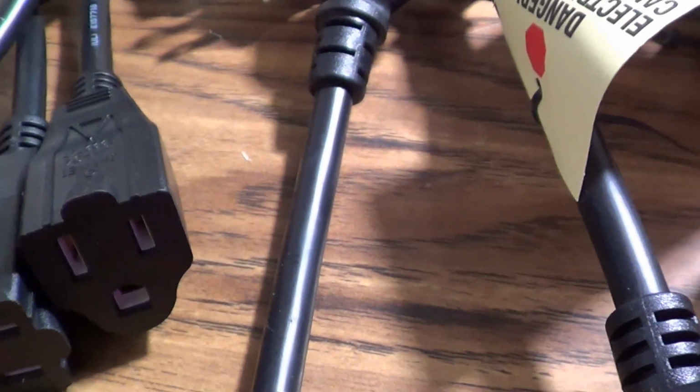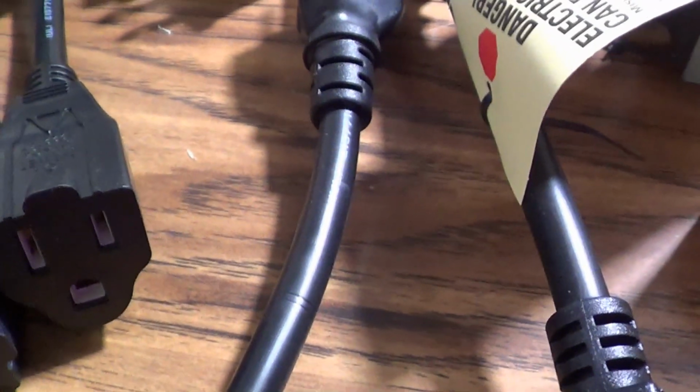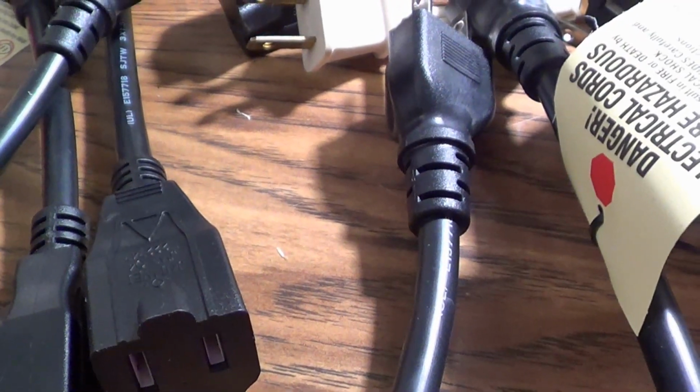Now, just let this be a warning. I've talked with lots of mechanical type folks over the years. You see that where the zip tie was? That it's already just from shipping eating into the insulation? That eventually could pull something to where it goes intermittent or causes other issues as well. And it's not cosmetic either. I could rub that like crazy and it would still stay there. So there's still little dings in the insulation just from the zip ties. Again, hard plastic and soft insulation over the long term are not a good combination.